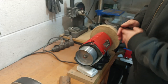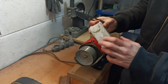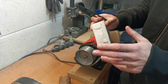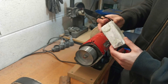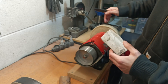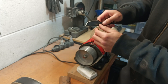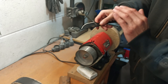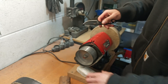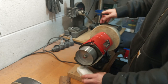This is a felt wheel and I'm using ultra-fine stropping compound. It's not greasy or waxy — it's actually compressed dust, so it doesn't load up the wheel. This has advantages and disadvantages, but in this case it's quite good because it doesn't glass the surface of the wheel and it allows it to micro-convex the edge, which is what I'm looking for. I want to be slightly more aggressive than I would be with hand stropping in order to remove this quite prominent burr. So a very soft and unloaded felt wheel is what I'm looking for. Let's go.